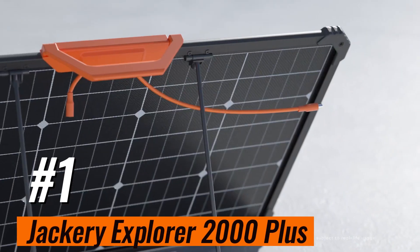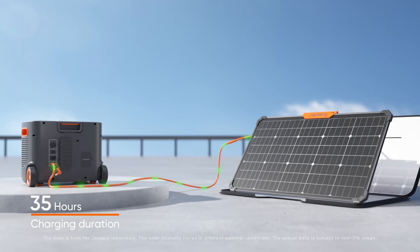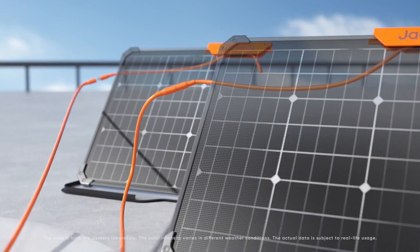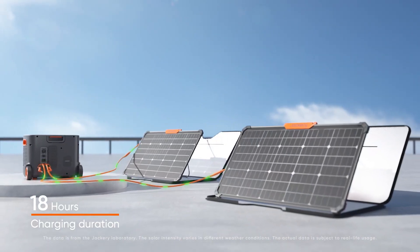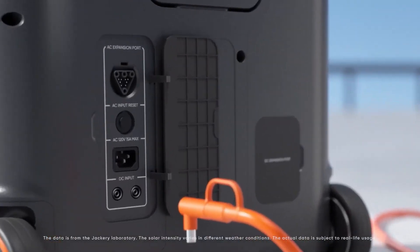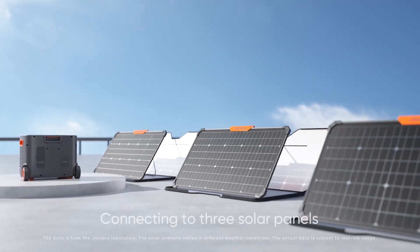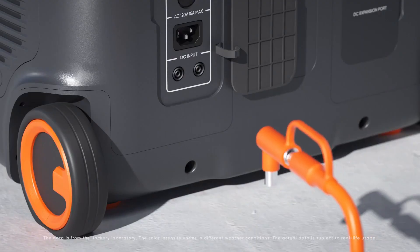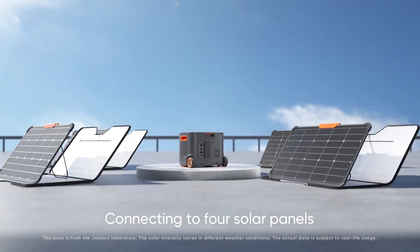Number one: Jackery Explorer 2000+. This Jackery system ticks a lot of boxes — it's versatile, expandable, durable, and dependable. The Explorer 2000 Plus has a decent mix of ports with support for fast charging your gadgets. You can double or triple the 2,042 Wh capacity by adding battery packs — they stack neatly — and it works as an emergency power supply. The LiFePO4 battery should be good for 10 years, and Jackery has various protective mechanisms to reduce the risk of anything going wrong. In my tests, the capacity consistently matched up with Jackery's claims. It had no trouble with the kettle test — UK kettles hit 3,000 watts, though it chewed through 6%. You can charge it speedily from the mains, and I also filled it from 32% in a single scorching day with Jackery's Solar Saga 200W solar panel. Best of all, the fan is relatively quiet at around 30 decibels, and there's even a quiet charging mode you can toggle on in the companion app.